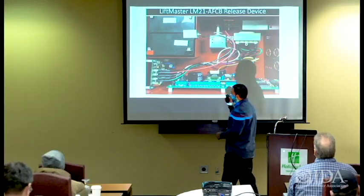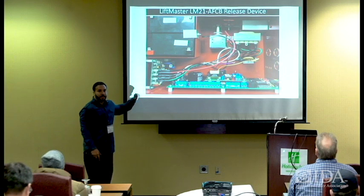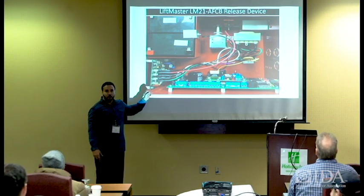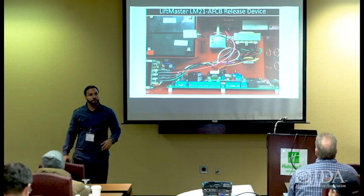We're protecting this circuit board here with 2 amp slow fuses. Those fuses go first. I would check that. If you got complete failure, you have power to this board, but you don't have any lights on this board. At that point, you know to go ahead and check these fuses, verify them, and make sure that they're okay. If they need to be replaced, replace them.